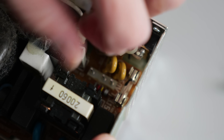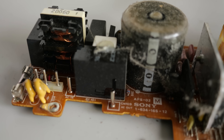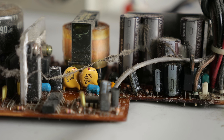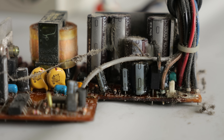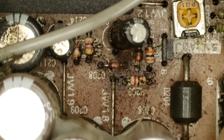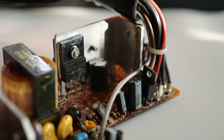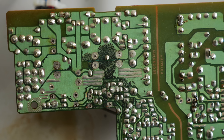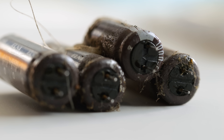I needed to get a good look at the PCB, so more screws came out and a few cable harnesses got disconnected. This power supply was made for Sun by Sony, and the primary side looked fine, albeit dusty. But the secondary, or DC, side was far worse. These capacitors must have been leaking for a long time. Everything on the top side of the board was coated in a horrible mix of electrolyte and dust. Cleaning the board wouldn't be enough—many of these traces would need repair, and I was questioning whether that would even be worth it. Sony made good products back then, but they sure didn't pick very good capacitors.